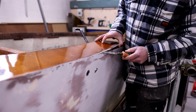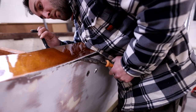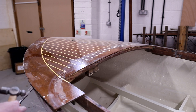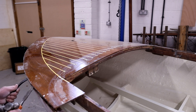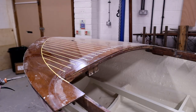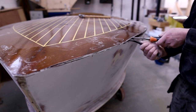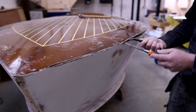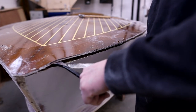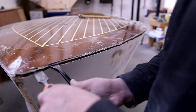Then we're on to the deck structure. The deck on this boat was very nice looking when it came in and initially we thought we'd just block it back and do a couple of coats of varnish. But investigating further we realized there were a couple of things going on under the surface that were potentially going to cause problems further down the line. The most pressing issue was that one of the carlins was snapped — that's the timbers that run down the inside of the cockpit. This was causing the deck to drop on one side, which was actually our only indication the carlin was broken.